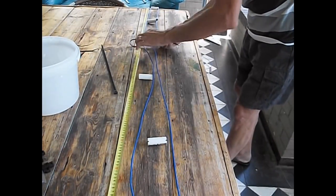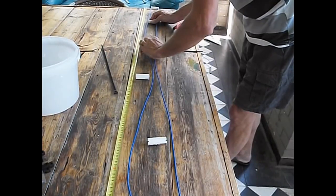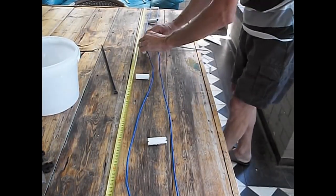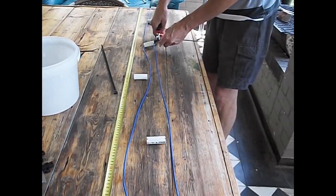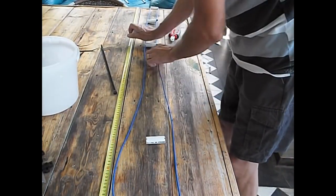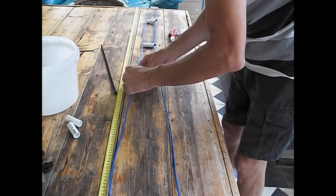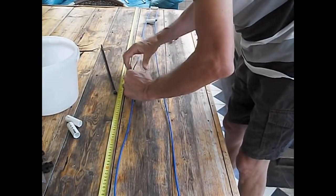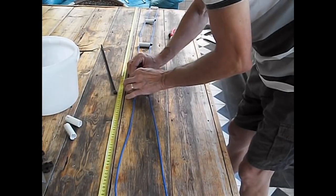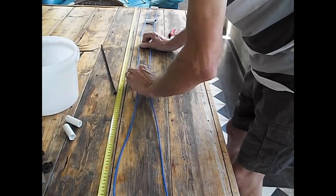That's nice spacing. Pull that through. Get you back in the notches. Before we get that last zip tie on, I have a chance to get the wire running straight. Moving up to the next one. Get the wires a little pull to straighten them out. Going to 90 here — we just did 60, now we'll do 90. Get that snapped in. Sometimes the notches are a really nice snug fit, which is convenient, unless I've got to try to pull the wire straight.